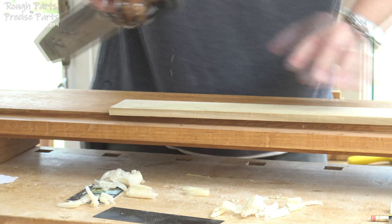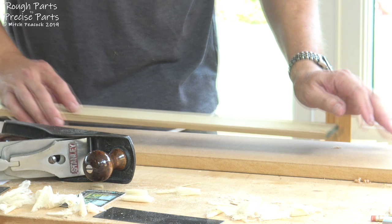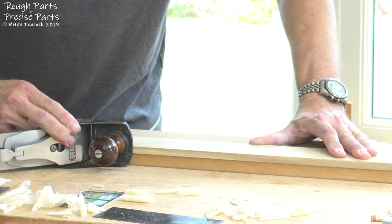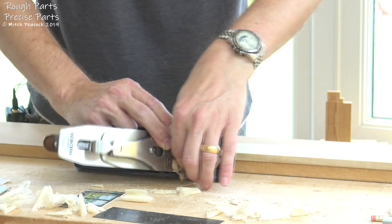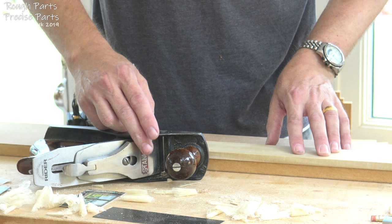Not everyone has one of these, so what else could you do? All you really need is a flat piece of board — here's a piece of MDF you can use instead of the planing board. It basically just sits on the bench, raises the work up a sufficient height, you just hang that work over the edge and you can plane that edge. Once you get a full-width shaving for the whole length of the board, you know you've got it at 90 degrees, as long as you've set your lateral adjuster so the iron is cutting at 90 degrees to the board. Checking it — it's now lovely and square.